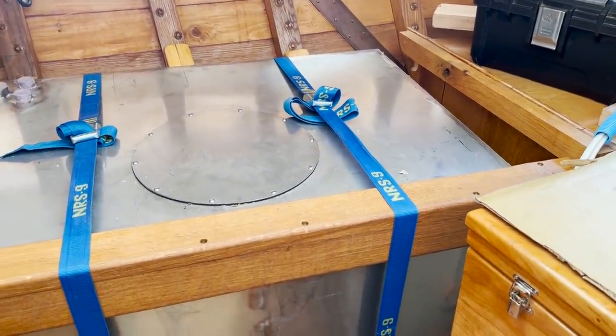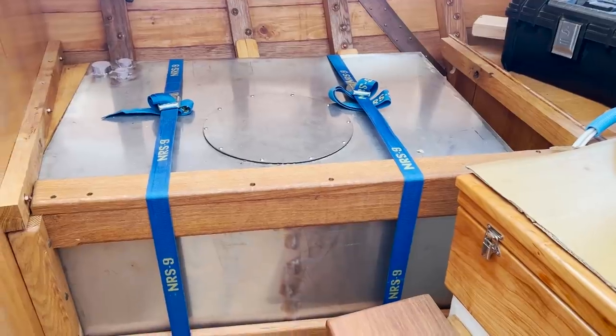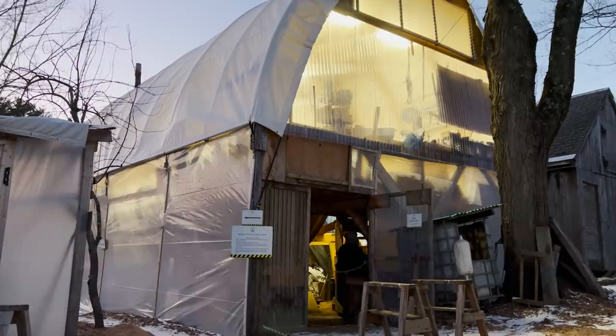and really only fill it up if we're going for a big crossing, or if we're going somewhere where we're not going to be able to run the water maker. And this tank will be the one that is the last one filled and the first one drained, because it's the one that will most affect the balance of the boat.